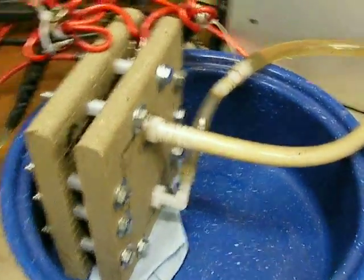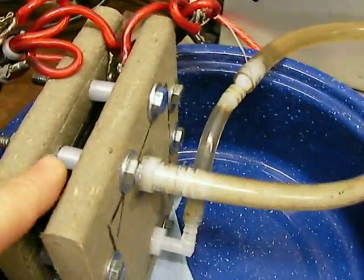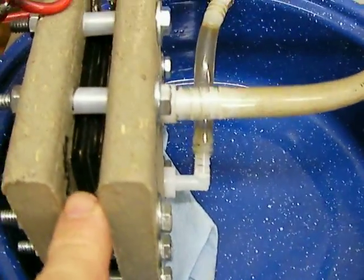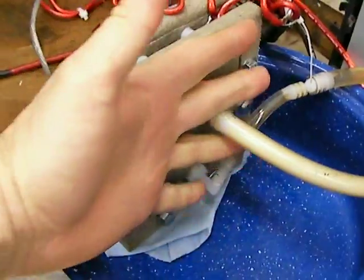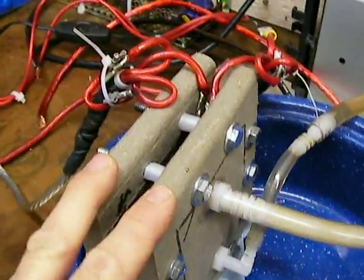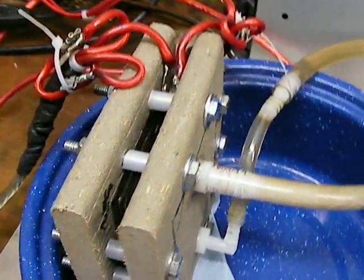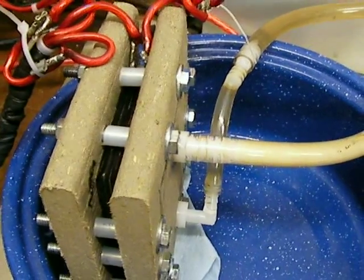Advanced hydrogen — this is a little three-inch by four-inch cell. These plates are nickel; there are five plates inside, that's why it's so small. This little tiny cell, the size of my hand, costs over a hundred dollars to build. That's nuts, isn't it? It is pure nickel — the plates are thirty-five thousandths thick.